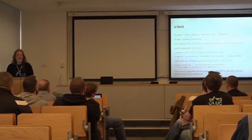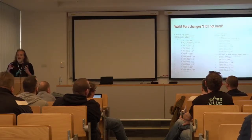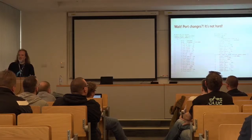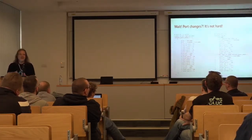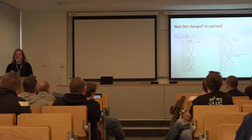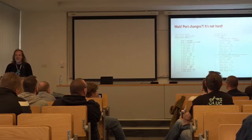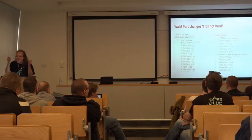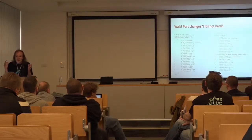I ported those display changes and got a working display in U-Boot — victory! It might seem extremely complicated or hard, but basically that's it. On the left side you see the changes which original developers made for the 2.6 kernel, and on the right side you can see the changes I made in U-Boot to make it work. Basically you compare the names of the variables, change a few of them, and it works.